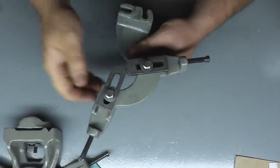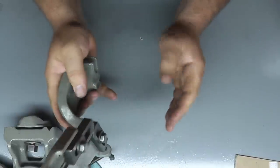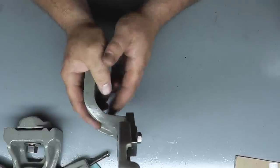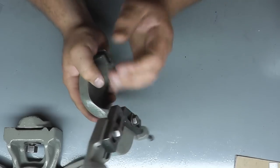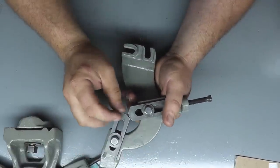Okay, first let's take a look at the follower rest. As you can see, it's cocked off to one side. This basically bolts up to the side of the carriage, and this puts the rest fingers roughly in line with your tool bit. Your tool bit will be on the front side of this, and this will follow behind your tool bit and keep the part from deflecting away from it. Now, the way that these came, they had cast iron jaws.